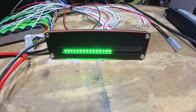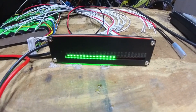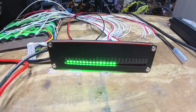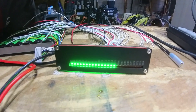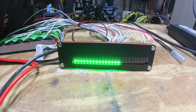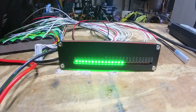Alright, I've got a couple of lights lit up here on the MaxGo BMS. You can see some LEDs have popped on — that means those cells have reached full charge and now the BMS itself is bleeding off the excessive voltage. Looks like that's the whole battery pack. Since it was only 15S, those cells are now maximally charged at supposedly 4.2V per cell — we're about to check that.